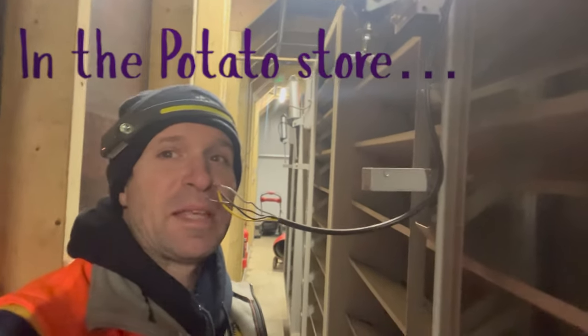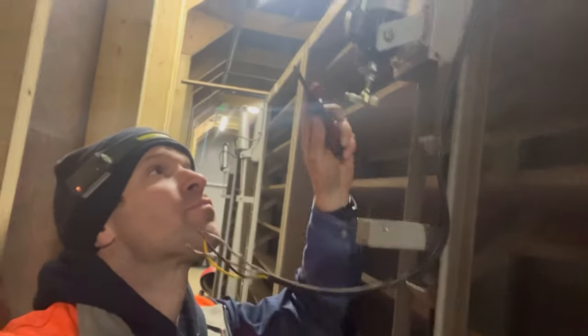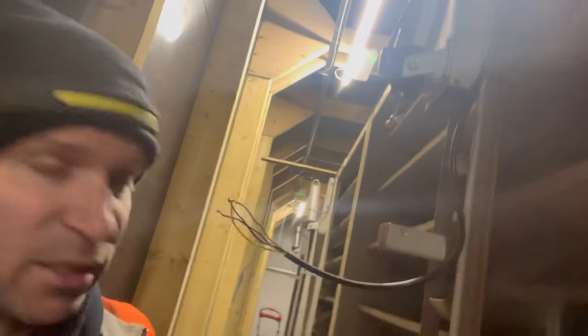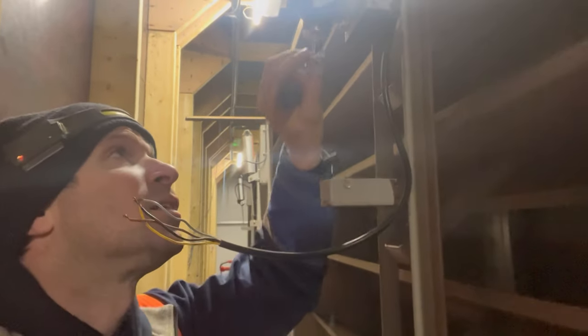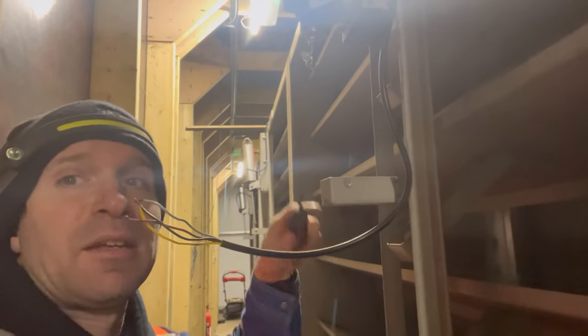So I'm starting the week out on a technical start. I've got these actuators. There's a micro switch in, and it fails or it sticks, so it renders the ram useless. So it's just a case of getting a new micro switch on. And I've got four out at the minute, so I'm going to get them all off, ready to take in for a refurb.